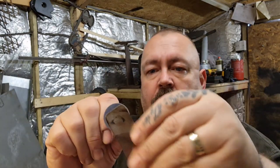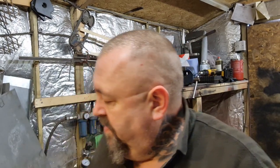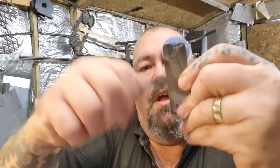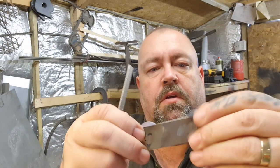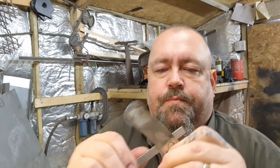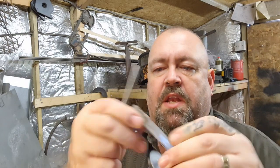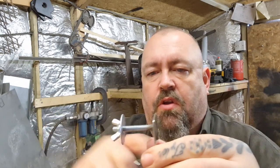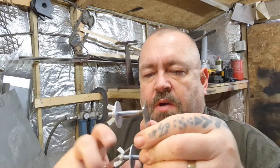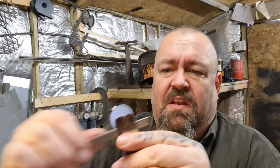So that's it, we'll take that back in the house. I've just got a little burr here — using a needle file just to clean that up. We're done, I'm happy with that. We'll take it back in the house, get it painted — paint the face so it all looks nice and pretty and black. Some of you are going to say that's galvanised and you should have taken all the gal off before welding — galvanised is poisonous when you're welding, and it is — but come on, it's more spot weld than anything. We're done, go back in the house.